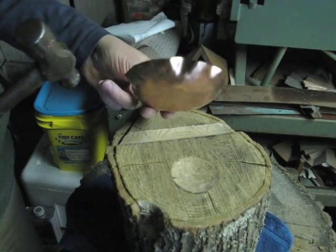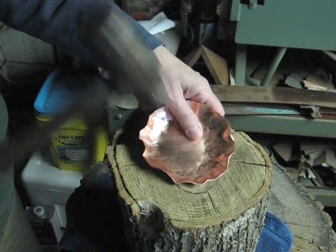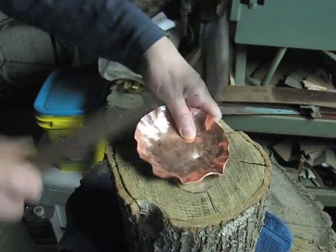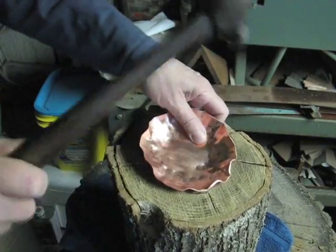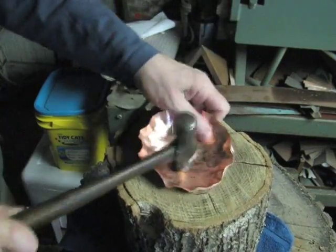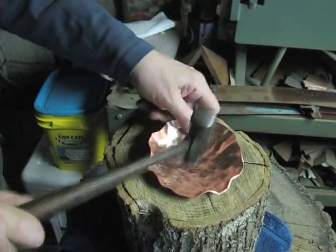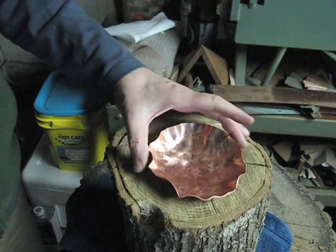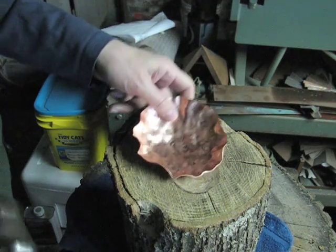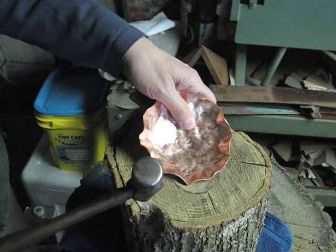As I move in toward the center, you can see that it's getting a little wrinkled and it's also feeling a little harder. The metal is not quite as soft even though it is still annealed and hasn't been hit in the center yet. Already you can see we have like a little candy dish kind of shape. This is all wrinkled and I'm going to start to take this out by doing it the second time now, by striking a little bit closer than I did the first time.